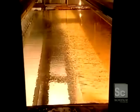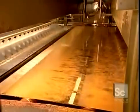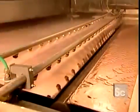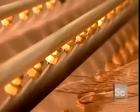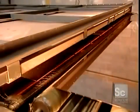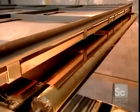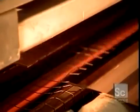The factory will seal this silver backing with two coats of paint. Paint by itself, however, isn't enough to protect the silver in the long term. So they first spray on a layer of copper. Sprayers rinse off the excess copper, then the panel passes through a dryer at almost 160 degrees Fahrenheit. This evaporates the moisture on the surface in just 75 seconds.